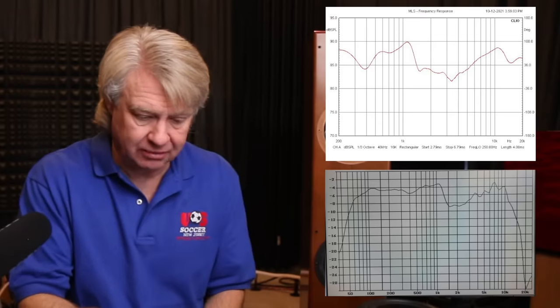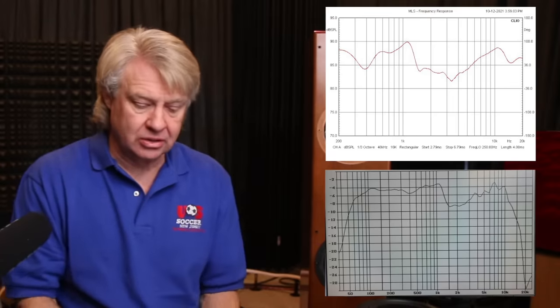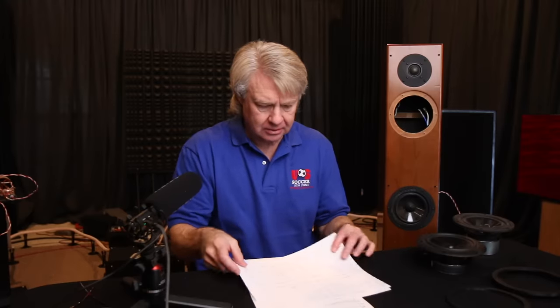The factory splices in a near-field response from about 300-400 Hz and down to create a full-range response curve. We don't do that — it's really just a guess because you're adjusting amplitudes to where it looks like it crosses and fits, and it doesn't tell us that much. At the very top end, the factory measurement shows the response completely falling off. Tweeters don't typically drop off that sharply, so I'm not sure what was going on there — we didn't measure it falling off that badly at all.